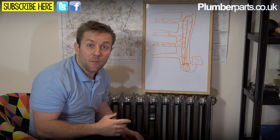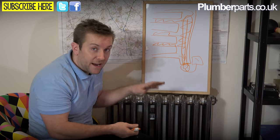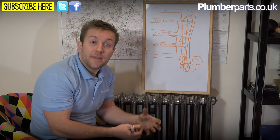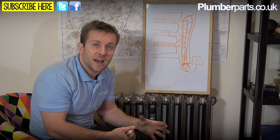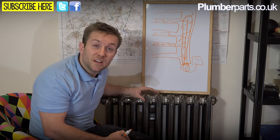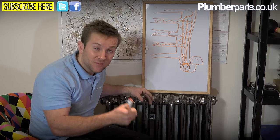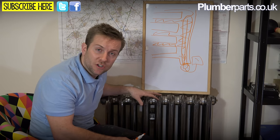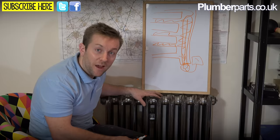One important thing to think about when filling one of these radiators after installing your element: if it's sealed and not on the heating system, you need to allow somewhere for the water to expand when heated. You can't compress water, but you can compress air. When filling your towel rail or radiator, be sure to leave a couple of inches as an air cushion at the top of the radiator to allow that water somewhere to expand into. That's really important.